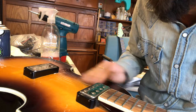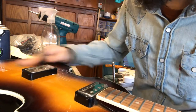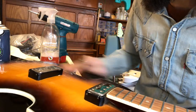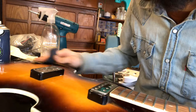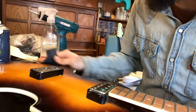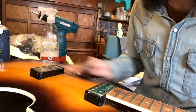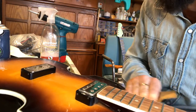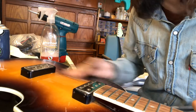This is a spruce top violin bass — I'm following the grain and just wearing into the nitro. I'm getting some of the edges as well, rounding everything over, giving it that worn-in feel with no sharp edges. I'm always following the grain so that when we come to do buffing, there'll be some sanding marks but they'll all be in lines.